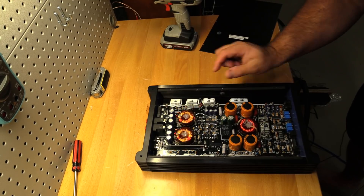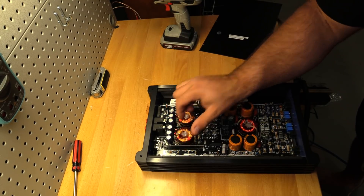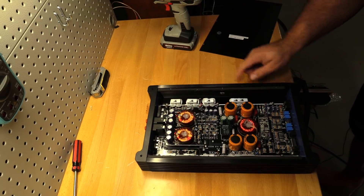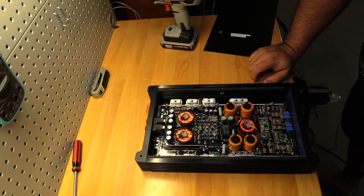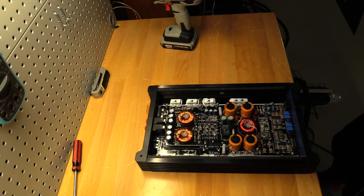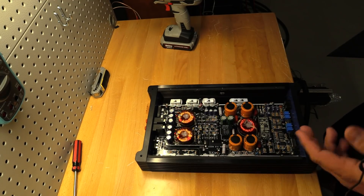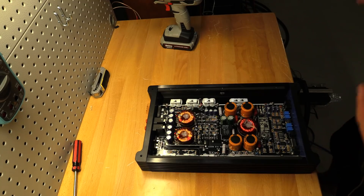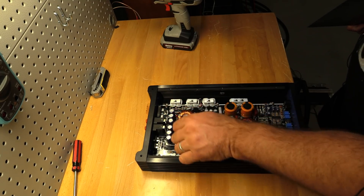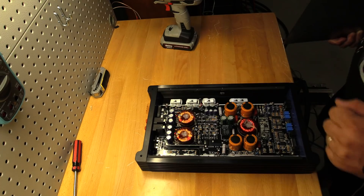One issue I do see inside: these toroids are not very well seated — I can jiggle them with my finger. When you're thumping with 1,000 watts RMS and you've mounted this to your box, it will vibrate them to death. I pointed this out to Rockville and they said they'd get in touch with their build house to get these seated better. If you're not mounting it to a box or you're using vibration-dampening material, it's not a big deal. But to make them last, you can seat them yourself — just put some silicone down along the base and you'll be fine.